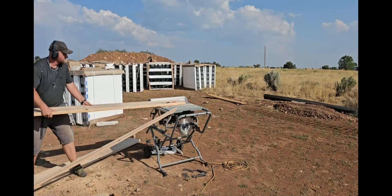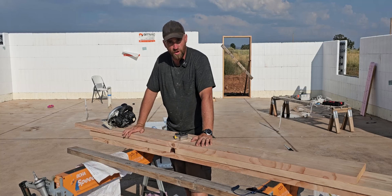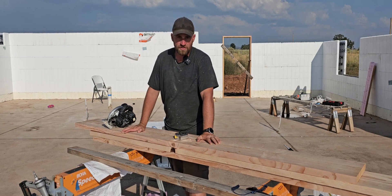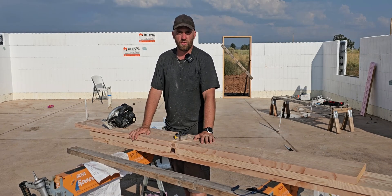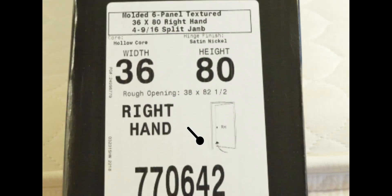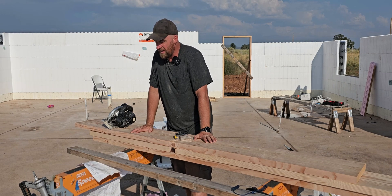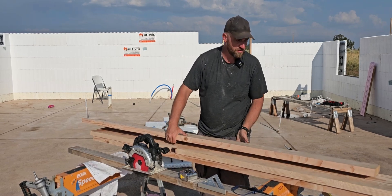This distance here is 10 and a half inches exactly, so I had to get two-by-12 pieces of wood and rip them all down. We've opted for three-foot wide and six-foot eight-inch tall doors, which comes out to 36 inches by 80 inches. If you look at any door package at a big box store or your local door seller, it will usually have the rough opening dimensions. Ours are 38 and a quarter inches wide and 82 and an eighth inches tall.